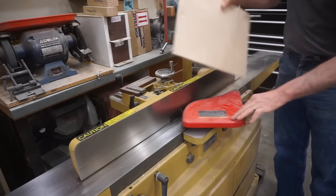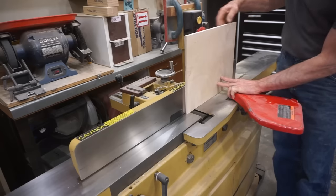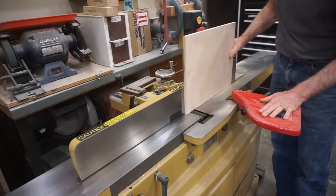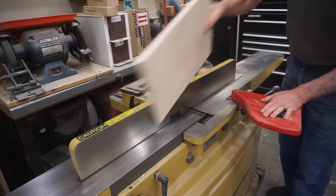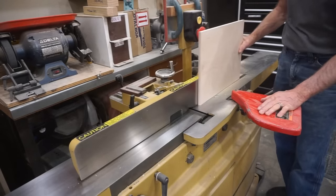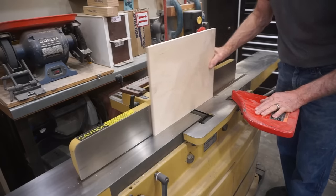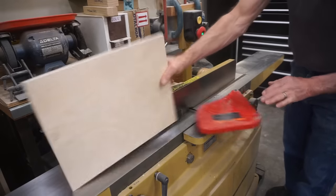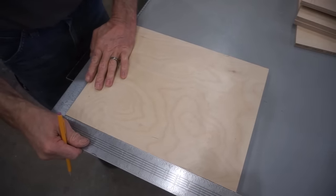As seen in other videos on Next Level Carpentry, to square up a piece on a jointer, I merely set the depth of cut to the amount I need to trim off to make the piece perfectly square. Then by setting one corner of the piece on the outfeed table, I take a couple passes over the cutter head. First to remove the tapered amount necessary for squaring the piece, and a second pass just to clean up the edge. And you can see the perfectly square corner I get with this simple step when I recheck the piece with a framing square.